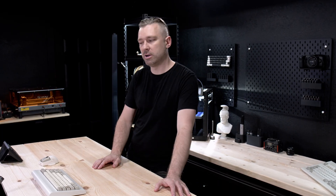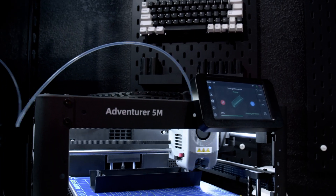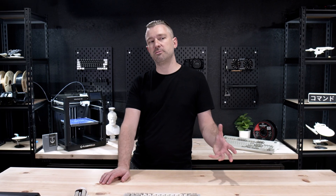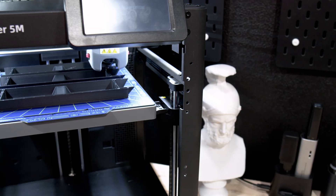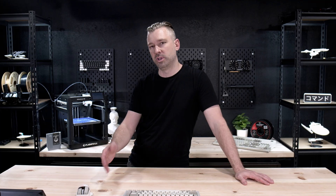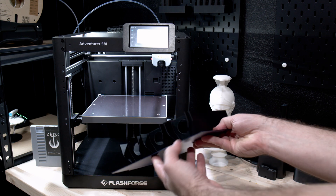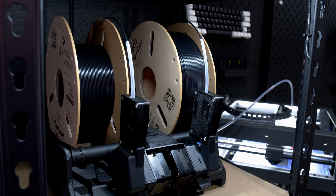In this test, we're using a fairly decent amount of surface area on the build plate, and we see that during the life of the print we don't really experience any warping or releasing issues. Once our print is complete and removed from the printer, we have no issues with adhesion — we still have to pull the part from the build plate itself. We then duplicated our part, increasing the overall surface area. Just like the test before, we're not having any significant issues, and keep in mind this is the worst case scenario: a mini split blowing in the studio on open frame FlashForge 85Ms with a 6-hour print time.